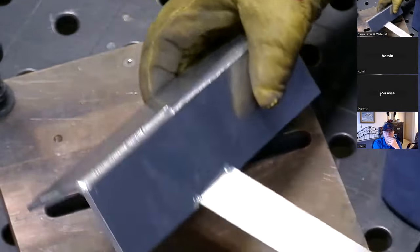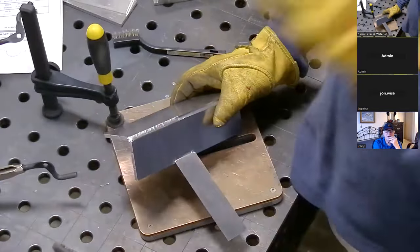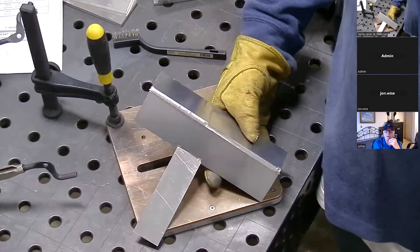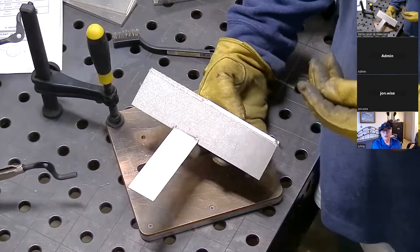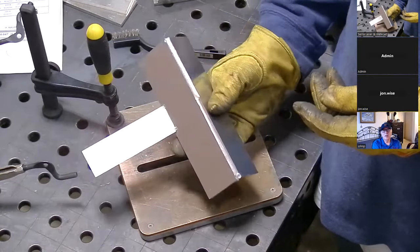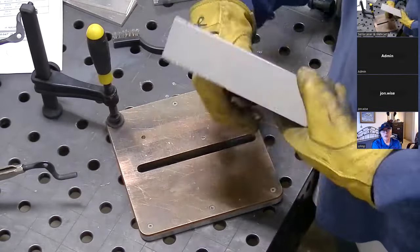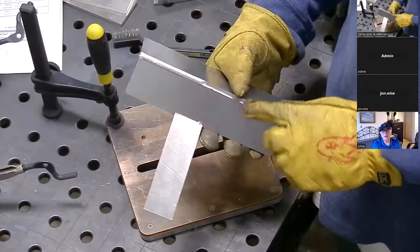I can't say for sure that this is a 2000-only thing — the width increase. This new software on this newest machine may come on all the new machines; I'll have to look into that — the plus 90 over the plus 50. That's full penetration, but it was already penetrated, so I could almost certainly do that on the first pass. This was a double pass, so I can't say for sure.